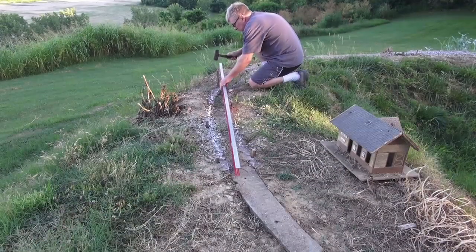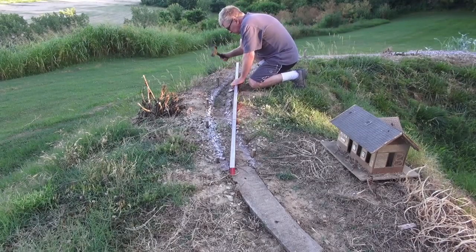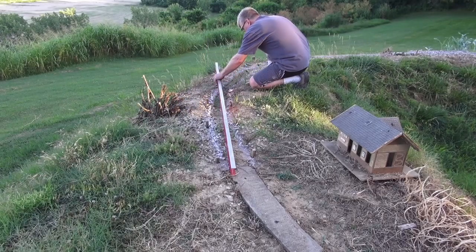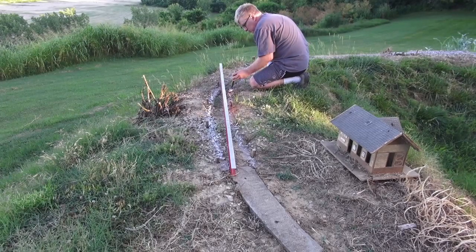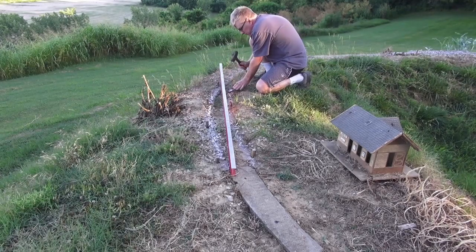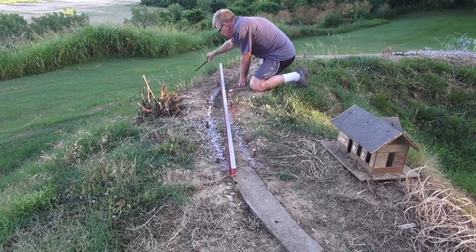So using an 8-foot level and some scrap wood stakes, I hammered the stakes into the dirt following the white paint lines on both sides of where the main line would go, making sure that the 8-foot level I'm using, coming off the cement roadbed already existing, gave me a perfectly level area all the way around the entire 10-foot radius curve for the length of the 23 feet that I had to fill with cement.